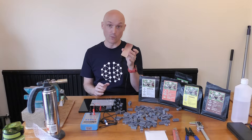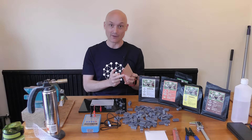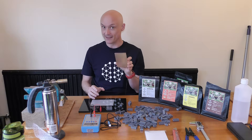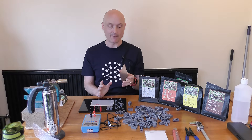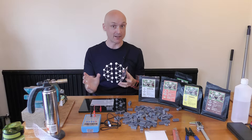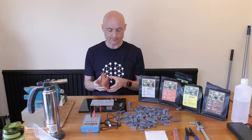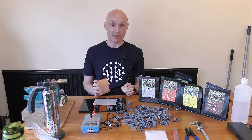First I'm going to solder some wires to each of these plates so I can test the capacitance with our capacitance meter. I'll need to use the blowtorch to heat the copper up first, because that's a lot of copper to heat with a soldering iron. Then I'm going to build the Lego structure for either side of the capacitor and stick the plates to the Lego with double-sided tape — that way I can take it apart again if needed, since I'm a bit concerned about how the electromagnetic wave spreads across the plate when using the AC signal on the capacitance meter. Once I'm happy I'll glue it to the polycarbonate base and add polycarbonate sides to make the final article.